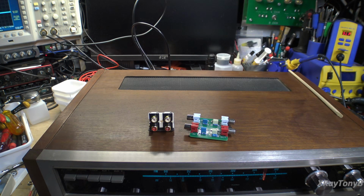That was fun. And now that we know that our phono stage is working properly, I guess we're ready to go on and check our quadraphonic. Now, I may have to do a little more research on this because there are a whole bunch of potentiometers on that SQ matrix module inside this receiver. Chances are they're all good and we won't have to touch it. But if we do need to make some adjustments, I'm not really sure how we're going to do it because there's no procedure in the book and there's not even a schematic for it in the book. So I'll have to go online and see if I can find more information before the next video. But we certainly know that the phono stage is working, and we should be able to work with this.